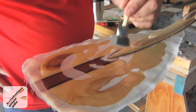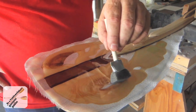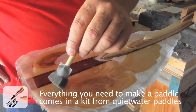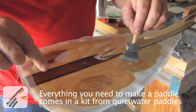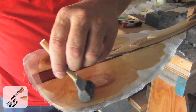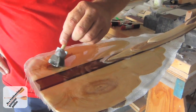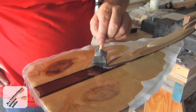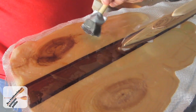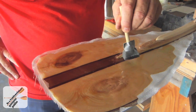You avoid almost all the air bubbles once it's starting to saturate and the wood's starting to shine through. This is knotty pine, by the way — there's the knot — with purple heart thin pieces right here, and then vertical grain western red cedar for the center shaft. For this first pour, I'm just trying to soak the fabric. Soaking doesn't mean leaving a super thick pool on top; it means just getting the fabric wet enough that you can't see the texture — the criss-cross pattern wants to disappear into the wetness, almost like the cloth is no longer there.